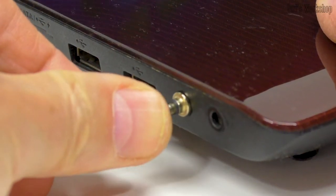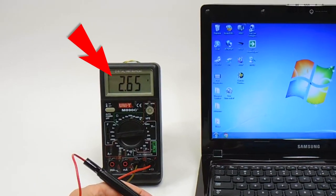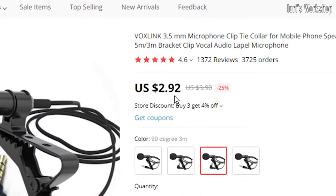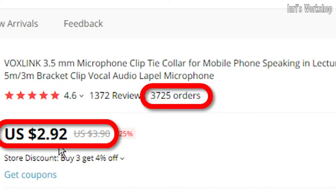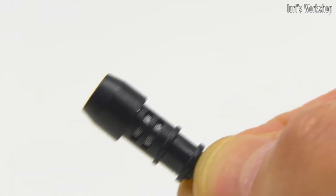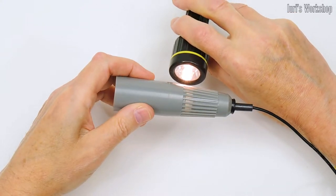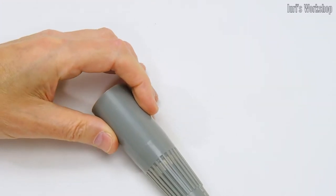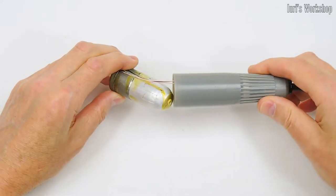The vast majority of all microphone sockets in household appliances are designed to use electret microphones. Especially for those who send me to AliExpress in the comments, I bought this $3 lapel microphone to show how useless Chinese goods can be. At the back of this microphone there is a mesh that simulates the additional acoustic input of the microphone. Such inputs form the radiation pattern and amplitude frequency response in more complex microphones, but the appropriate dimensions of the microphone itself are also required.